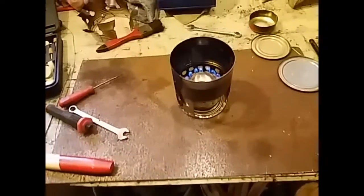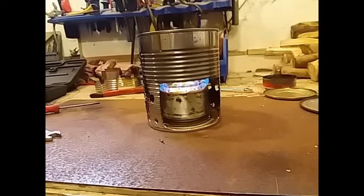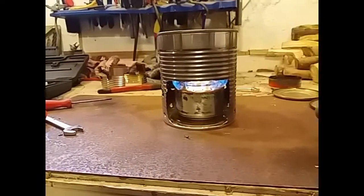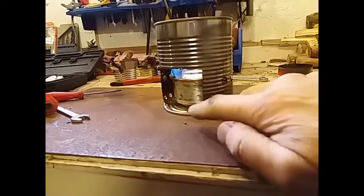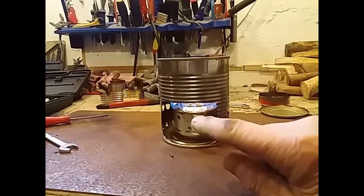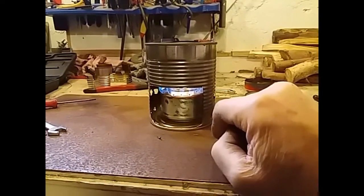When we were experimenting yesterday, we saw that the alcohol stove was starting very slow because of the cold outside. So I decided to try to make something that is a combination of a pot stand and a preheater. Until now it works. It's not a pot stand yet, but it's a preheater. You can see I made some holes here in the range of the flames and some holes over here. But when I put a pot on, the flames go down and make black smoke, so I have to make air holes somewhere here.